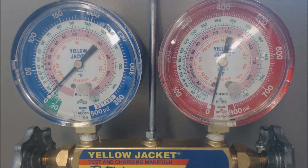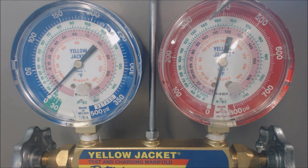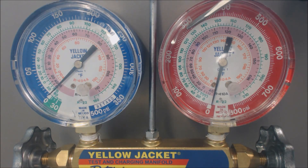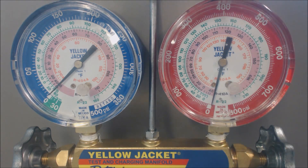Hey guys, this is AC Service Tech. Today we're going over high discharge pressure. The higher the pressure, the less efficient the system is. Say you have an R22 system and it's all the way up at 350 psig — that is a very high temperature for R22. On lesser efficient SEER ratings, like maybe an 8 or 10 SEER, you shouldn't have it that high. At 350 psig you're looking at a saturation temperature in the middle of the condenser coil at about 143 degrees.